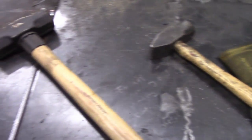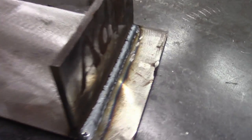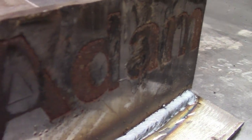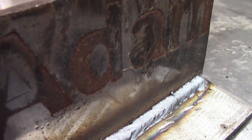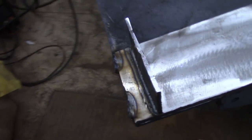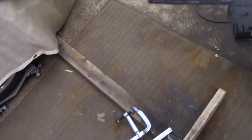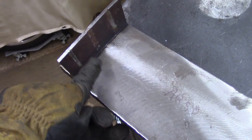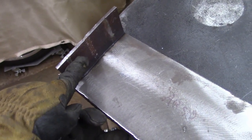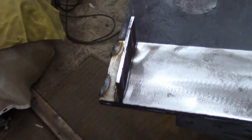That was 10 hits with the little blacksmithing hammer and then 15 with the sledgehammer, and I realized that wasn't really doing any damage — basically only bent it the tiniest little bit. You can see the hits on the face there. Obviously this isn't moving. Since that test was a complete failure, I welded the plate to the edge of the table because the clamps just keep flying right off. I'm going to hit this steel from the backside — it should be easier to break that way. This is the ER70S-6 mild steel filler wire right there.